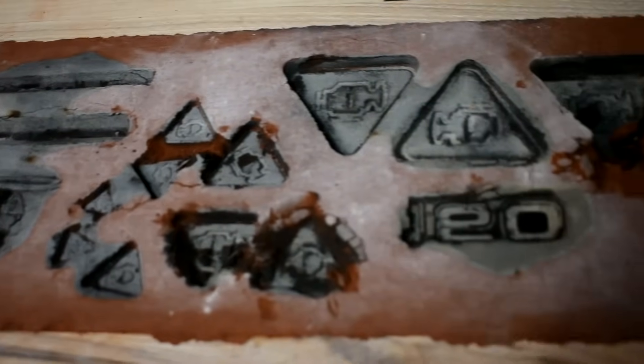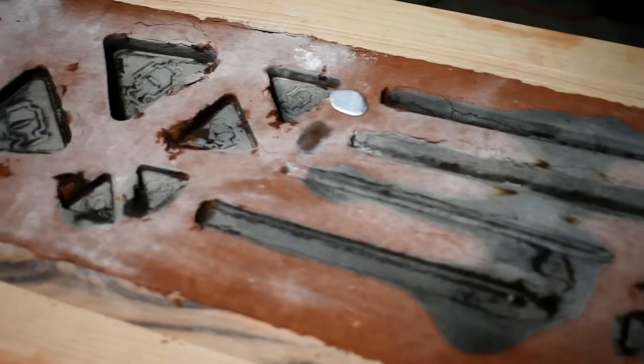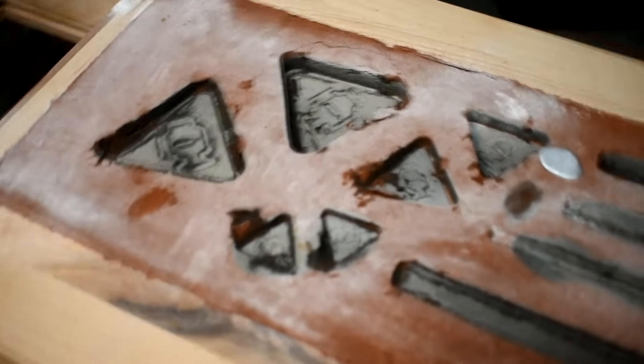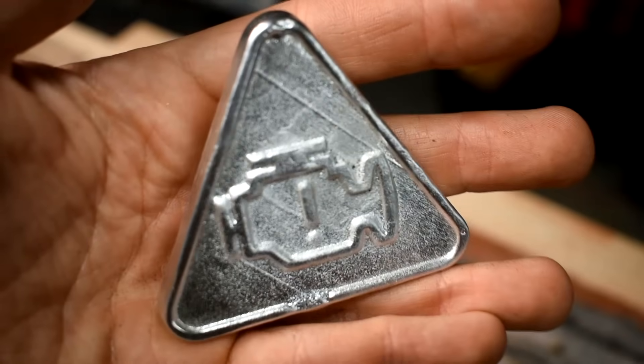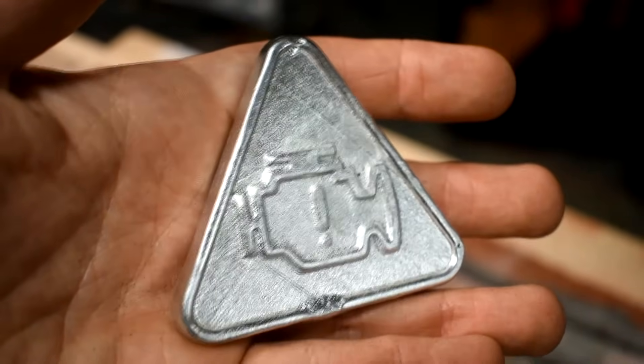The sand is a little more burned than usual because I was trying to get the temperature higher to get better detail — it kind of worked. By the time I poured one of the nicer looking ones, the metal had cooled a bit and I got rid of some of that nasty sand contamination. Plenty of things in the real world are cast like this, but should you be doing it? I can think of only one case where it makes sense: if you're making simple, one-sided trinkety things that look cool, aren't structural, and you won't machine them — mainly just aesthetic. Then go nuts. Although ramming it up the normal way would work a lot better.